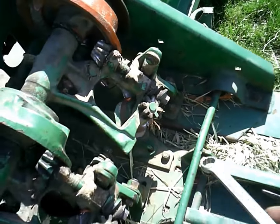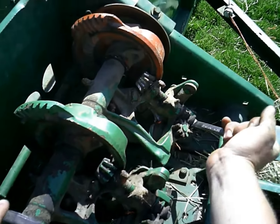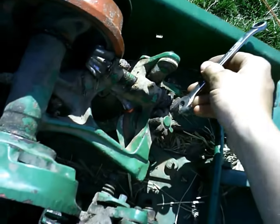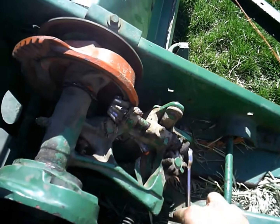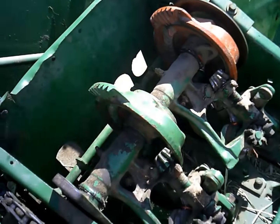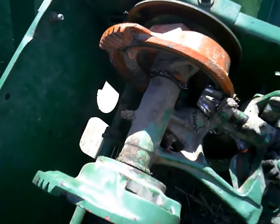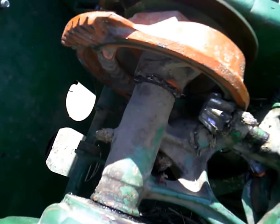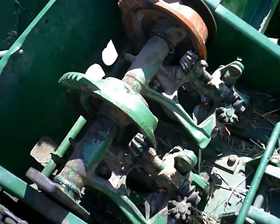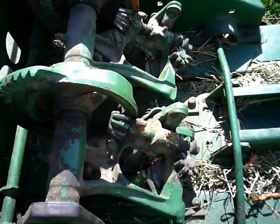I'll run it to make it tie a knot and see how it does. I don't think knotters get terribly worn out — people think knotters are worn out or say they don't run, but they've got a sweet spot in them. I think if you just disassemble the knotter and re-shim everything, it would probably fix a lot of it. Things can get pretty worn out before you'd ever have to replace parts because there are shims on each side of everything, so as long as there are shims you should still be able to shim it up, take play out, and make it keep working.